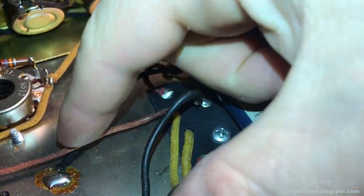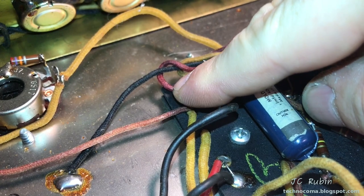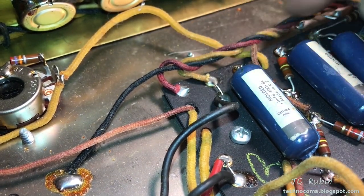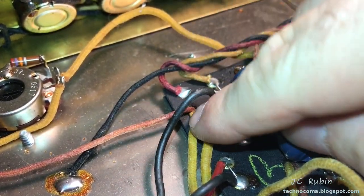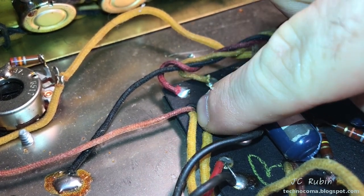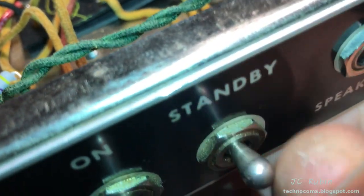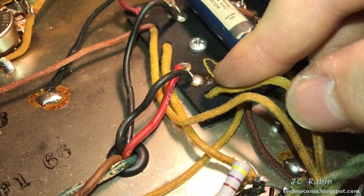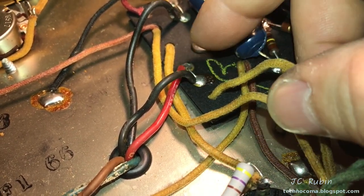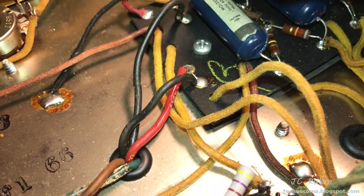This is how it works here. Here's the cable coming from the rectifier. And under the board, it touches this red wire here, and that goes out to those filter caps that I was just testing. It goes out and essentially comes right back, and it's filtered, right? And there's a yellow wire here, this top yellow wire that I touch. And that wire makes its way back, and it goes to the standby switch, okay? And that standby switch completes a circuit which allows that DC to flow into these two black wires here? This is that coil TR2, right?